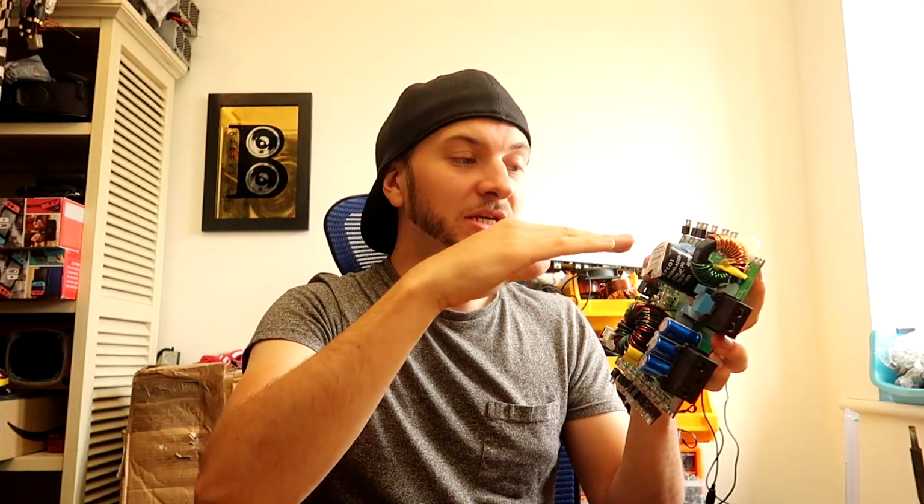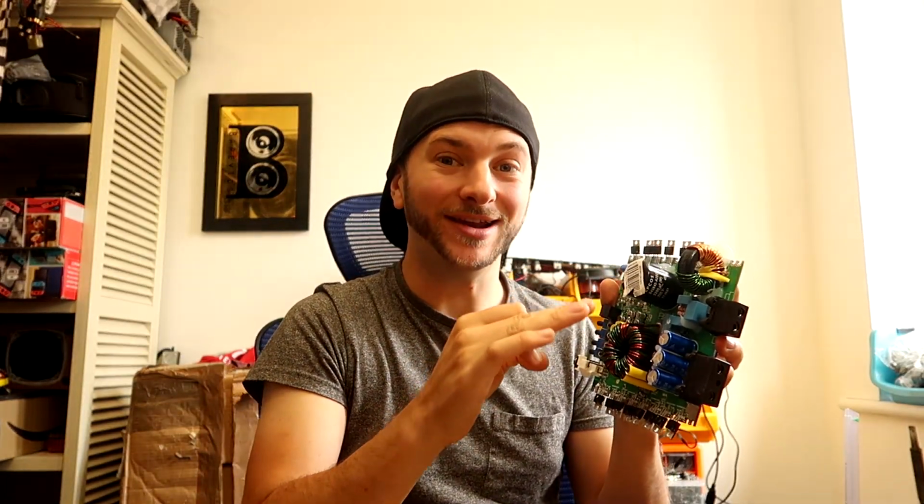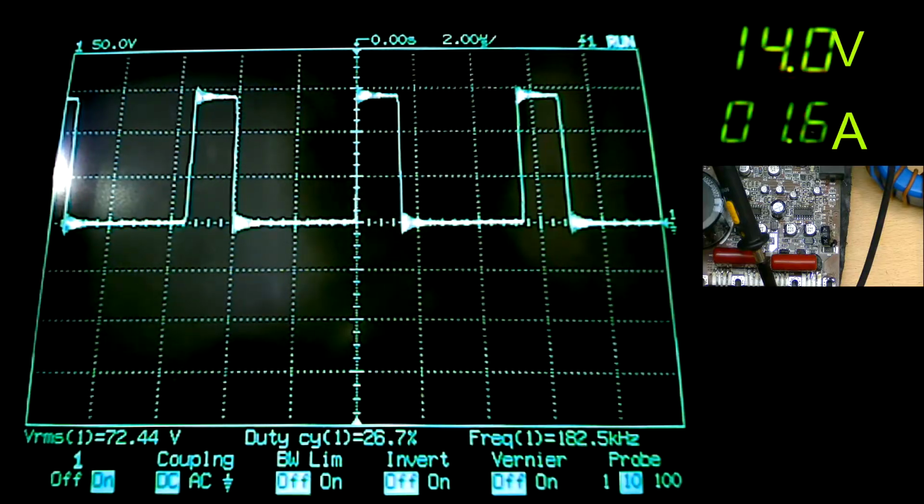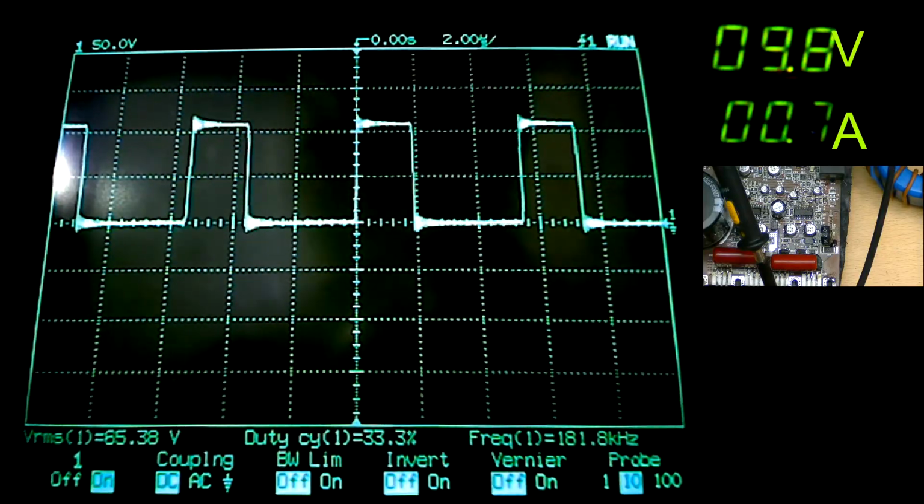So by reducing the duty cycle and causing the output sine wave to clip early when the rail voltage is higher, you're essentially causing them to clip early and therefore produce less total output power with a high rail voltage versus what it's rated for at 12.6. Either way, we need to figure out which components are responsible for this behavior and modify it.